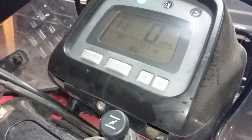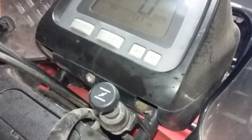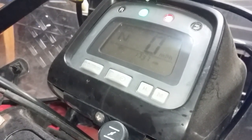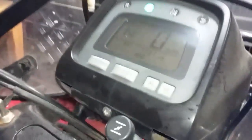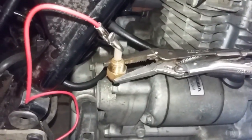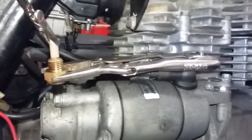So I've got the flame on the sensor right now and I'm going to keep warming it up until the overheat light comes on. There it is. I know there's been some confusion on whether or not that should be on as soon as the fan comes on — it should not. So I'm going to shut the heat off. There goes the overheat light — it went off. The fan is still running, and as soon as that sensor cools down enough it's going to shut the fan off.